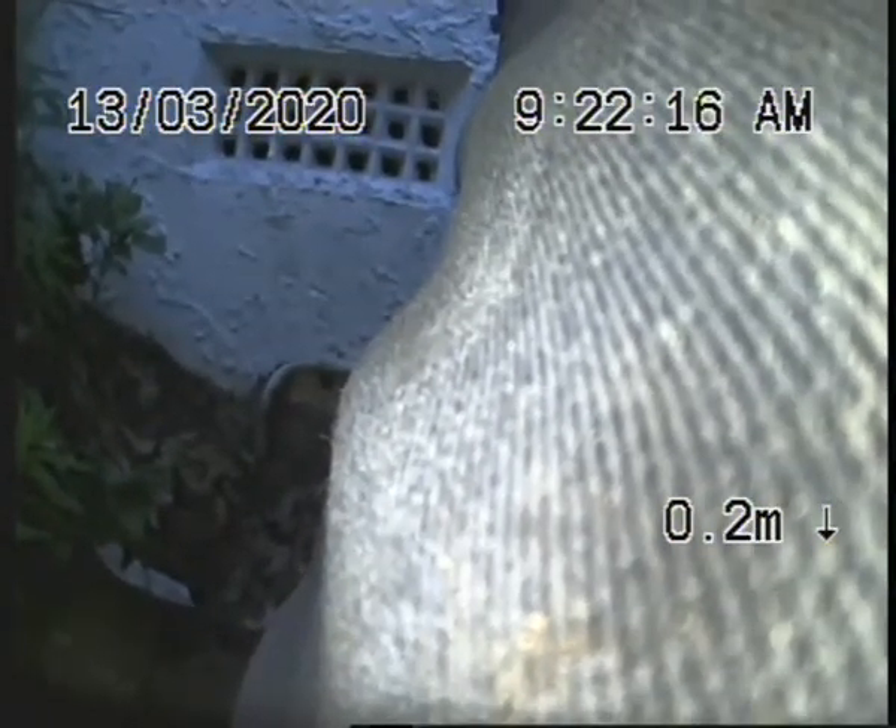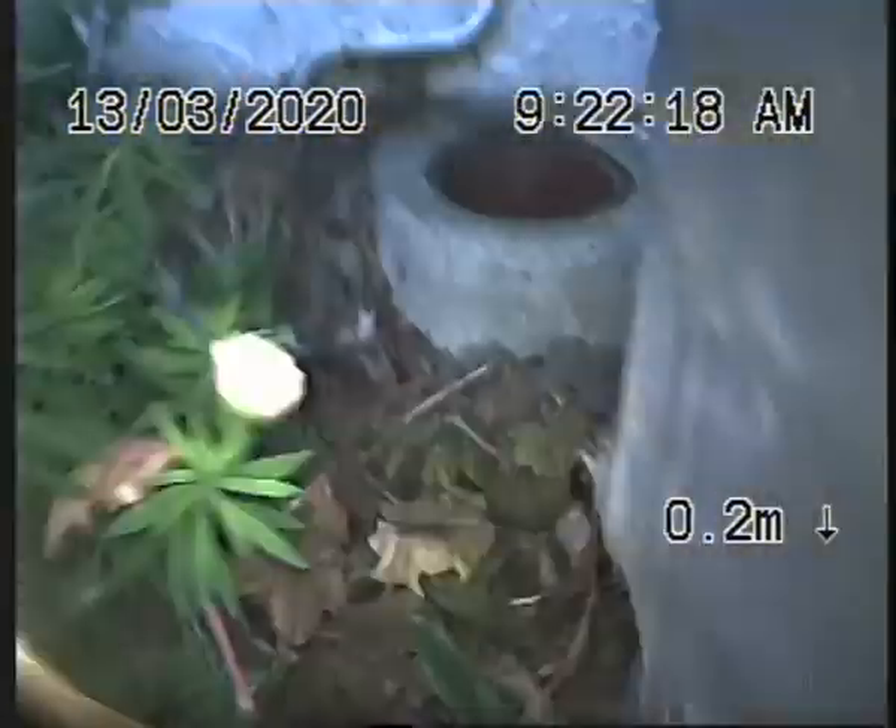This is Jonathan for Drain Doctor. We are at 4 Broderick Crescent. We're just going to re-camera the sewer from the same gully trap. So there's the gully trap there. On the other side of me is the terminal vent in case we needed access for lining. I'm just going to push down and get a decent picture of the drain. It's going to go slow through the gully.